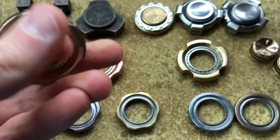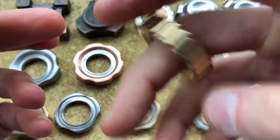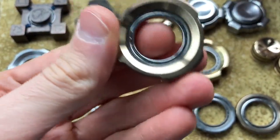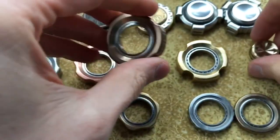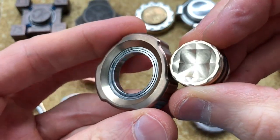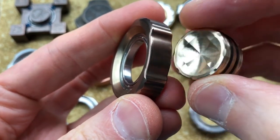Now brass is a copper and zinc mix, where bronze is a copper and tin. Generally, it doesn't have to be tin, but it is generally tin. And then if you look, you can see here the way it started, that lighter yellow, and it's getting nice and brown. Oh, there we go. Sort of like these colors right here. Now you're really starting to see it.